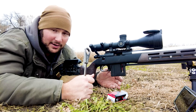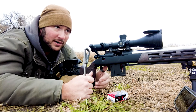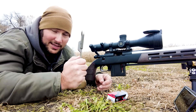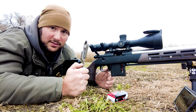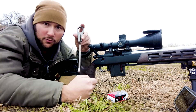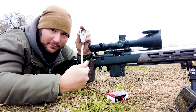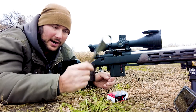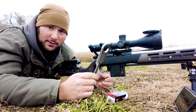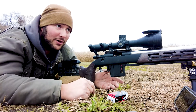The material usage on this target is not that great, so it doesn't add a ton of cost, but it does add a lot of performance. I used to have a design made from quarter-inch AR-400 and AR-500, and if you keep the stems skinny — if you don't have them bigger than any of the target surfaces, which is what it should be — they would actually bend and warp after one or two matches. After just one match you'd see visible warping where the paddle would start to bend backwards, so you'd have to keep on top of it, make sure you're shooting both sides — just a pain. So I just went with a monstrously overbuilt 3/8ths AR-500 design. It works really well, you never have to worry about the targets bending, you just get to go out and shoot and have fun.